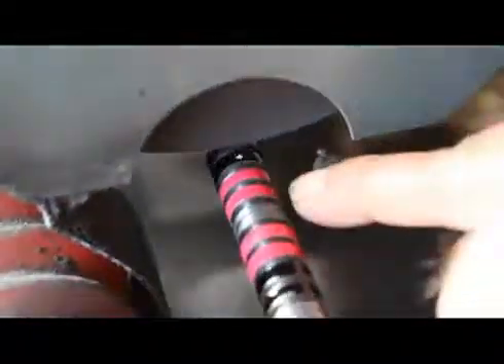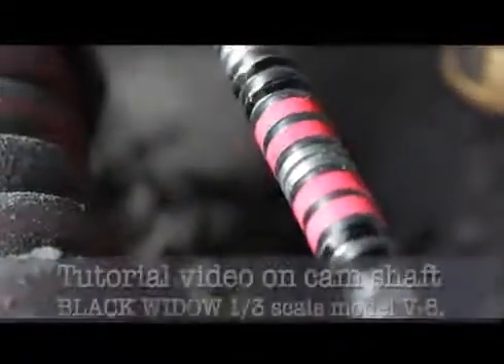The lobe split is generated right here — there's 115 degrees lobe split between the centerline of the intake and the centerline of the exhaust. The way I dial off my degree to get my firing order is with the degree wheel that we generated on the spindle of the grinding machine. The black lobes are the exhaust and the red ones are the intake. The grooves in the camshaft are where the oil goes around and down to the main bearings in the engine block.